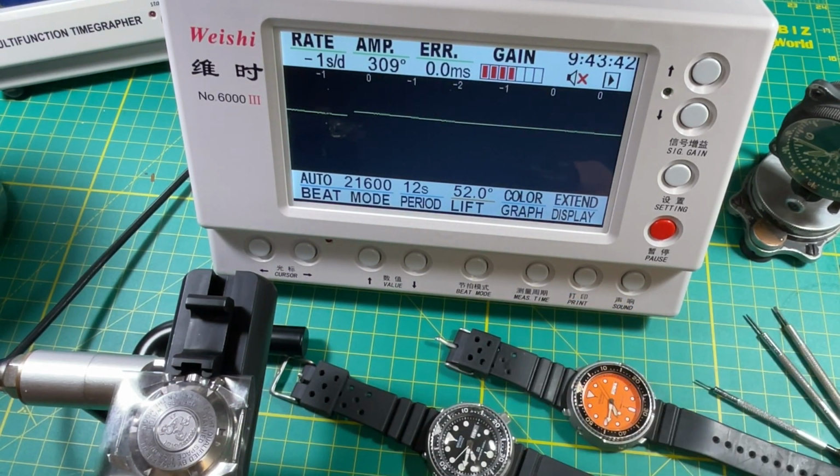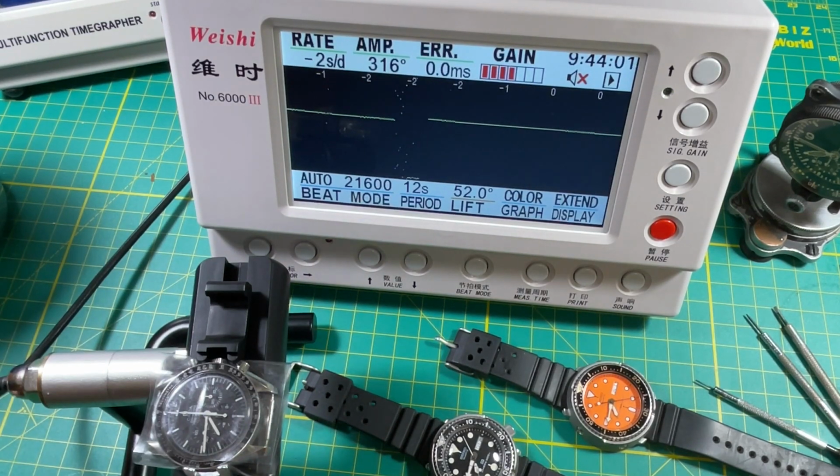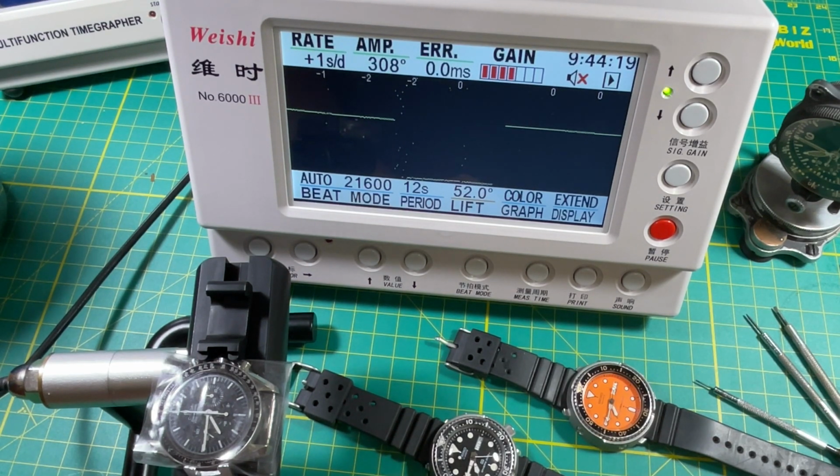So, how we doing? I think we're good, people. No, I didn't set this for face up, so I don't know if that affects the numbers. Oh, I see we're down here. We're good on our amplitude. We've got a hair more beat error. Well, I'm going to live with it. As a wise man once said, good enough for the girls that we date.